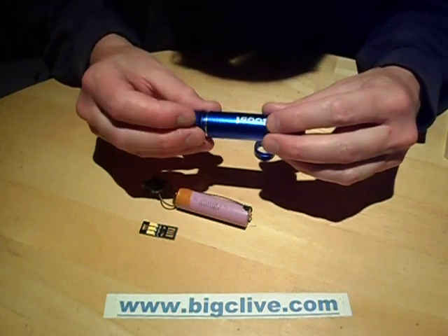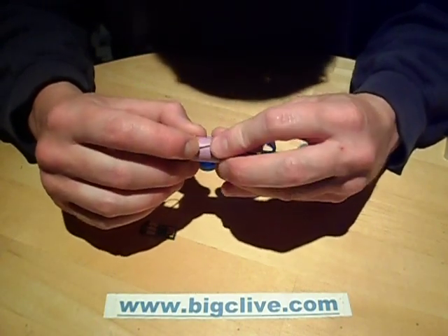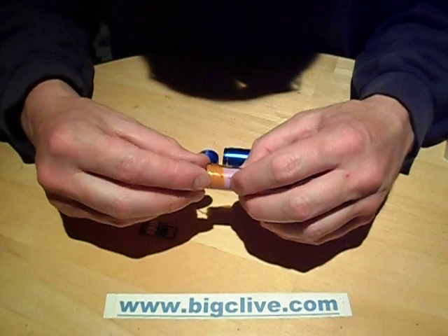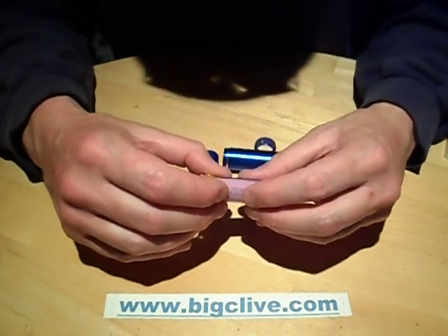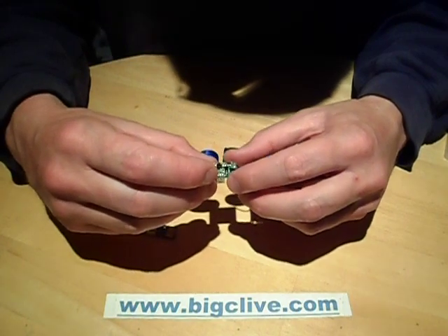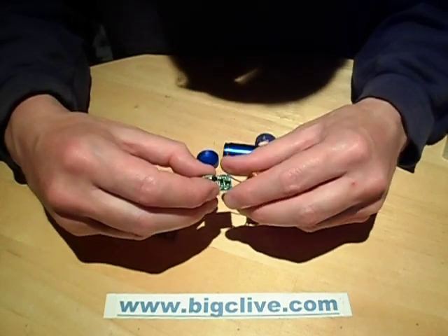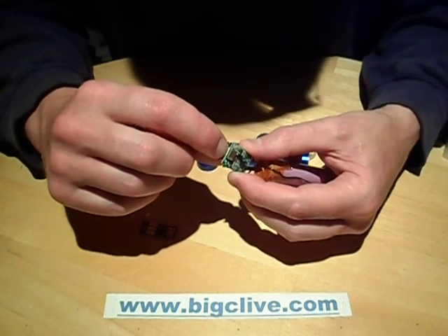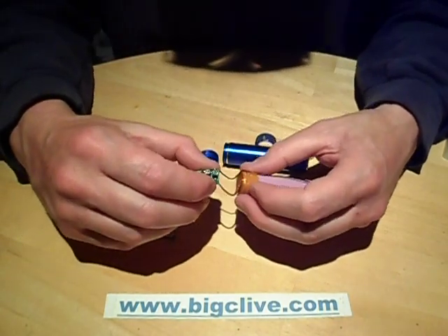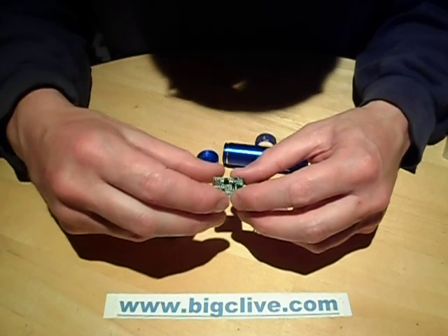It turns out they'd glued it shut, but it was openable with just bare hands. It's a very tight fit, and such a tight fit that when I pulled it out, a wire physically popped off the end. I thought, well, that's a good chance to stick a meter in series with it before I soldered it back on, and check the quiescent current — how much current it draws in standby. These versions are the type that run all the time; they always put 5 volts out. There's no button to press to activate it. They've got a small micro USB charging port and a main output port that's always got 5 volts on it. The circuit only really kicks in every so often to top that 5 volts up, or if you put a load into it, it then delivers whatever current is required.